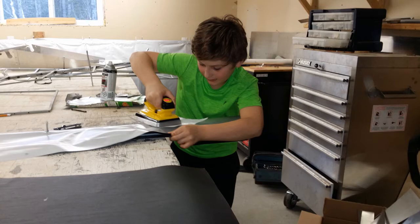One thing that's worth talking about, it's very important that you get proper equipment. We used a Toko iron for this, which is precision. You can set the temperature precisely. We also used a Steinel heat gun. Don't bother getting some cheap Chinese heat gun. It's imperative that you use proper tools for this job. We tried a couple on scrap pieces, two of them. One didn't get hot enough, and the other one was way too hot and completely destroyed the fabric on the test pieces. So then we just did what everyone tells you to do from Oratex and just bought a Steinel for however many hundreds of dollars. So it's definitely worth that investment.